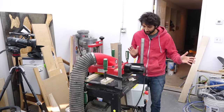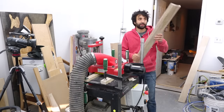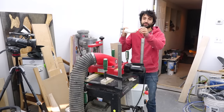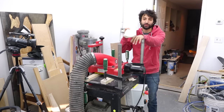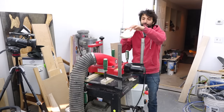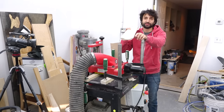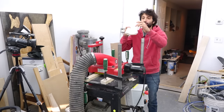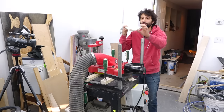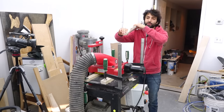And that brings me to the other little caveat with the rollers. The profile on this side gets cut deeper than this side. So as you get down lower into the profile, at a certain point the flat disappears and you have just this little point for the rollers to press on. And this actually disappears below the surface of the other flat area. Because the rollers are flat, they're only pushing on this side of the profile. So what ends up happening is with pressure over here, the molding wants to roll and turn this way.